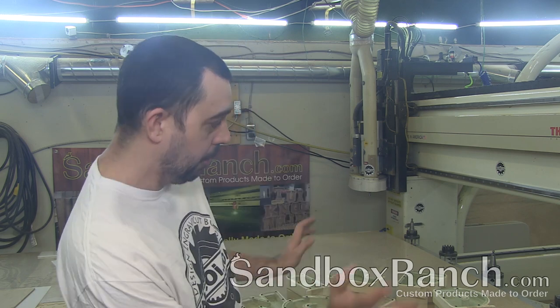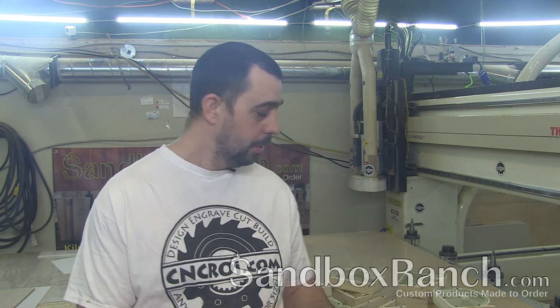And that's why I like having the diversity of equipment here in the shop, so that I could pick the one tool that would do this one job perfectly, and then pick the next tool that would do that one job perfectly. And that's part of optimizing the design. Now, sometimes it's not very efficient production-wise, because of course, throwing a sheet of acrylic on this machine here and chopping it out to make the front is dramatically faster than using the laser. But the laser produces a better result.